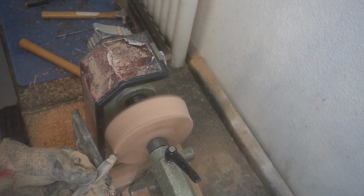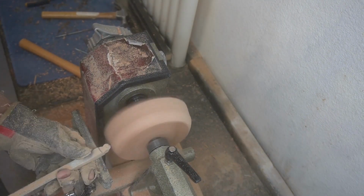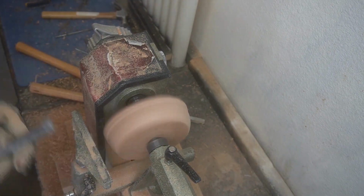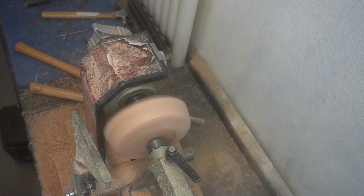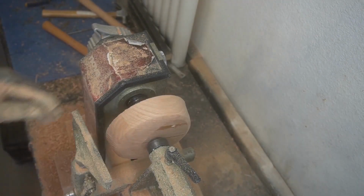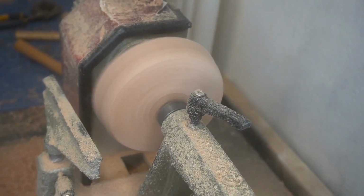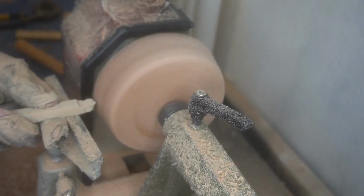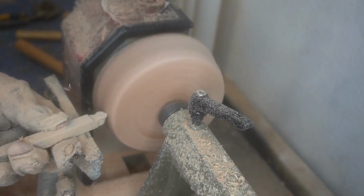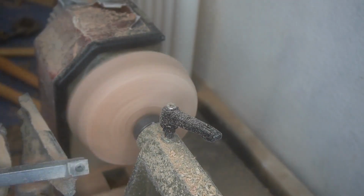And you can just see the amount of wobble that is on this. Just tons of wobble. The chisels aren't going through it as easy. I switched from the large carbide tool round to the smaller one that I had. It just ate at it a little bit better. And all I'm doing here is just trying to make a shape, essentially. Just get everything nice and cylindrical. And then trying to figure out what I'm going to do and how much material I'm going to need.